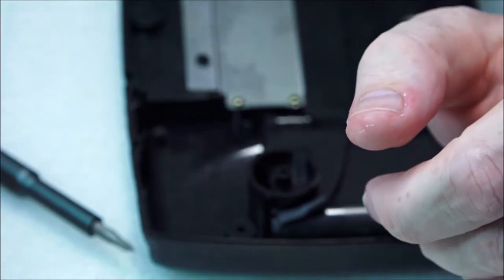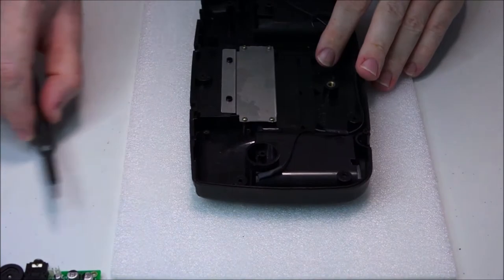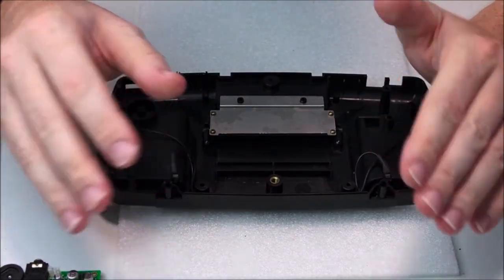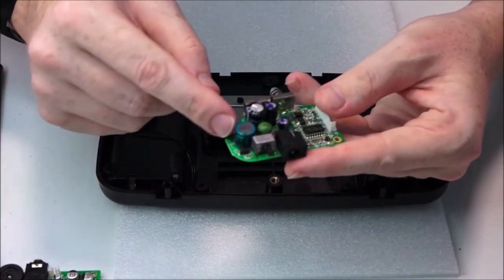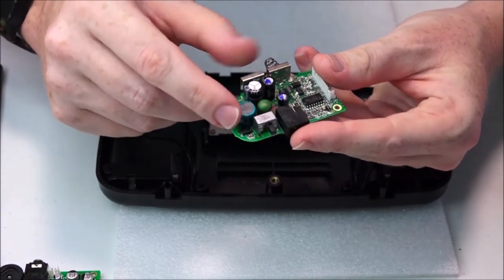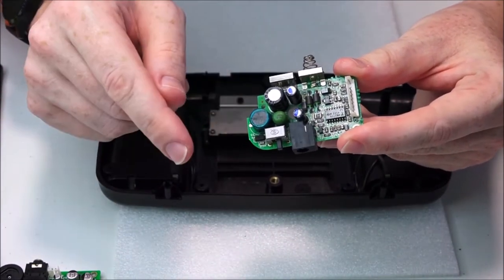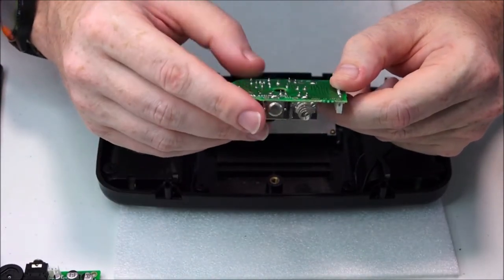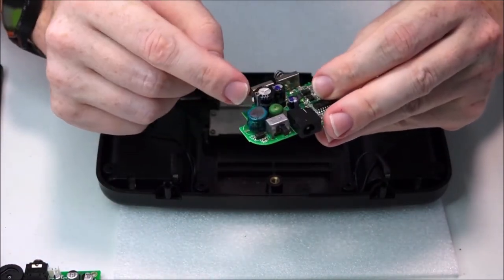At the end of the day, if worst comes to worst, I'll replace every single capacitor like I did on the first Game Gear. However, if we can get away with just replacing 90%, but some of the more difficult capacitors, just like back on the PCB here, with this large capacitor, which is very rare and difficult and oversized, if we can leave it on, great. If we can salvage one from another one, great for now, because then I can give myself a little bit of time, a couple of weeks or a month, to order some more in and then just resolder them in. So it doesn't need a video of its own. It's no different from anything else.